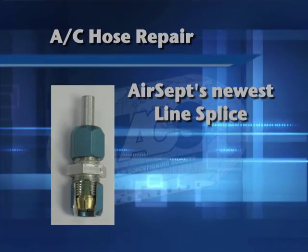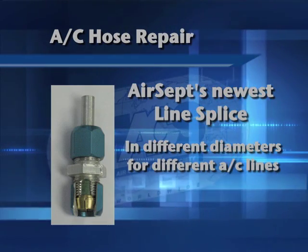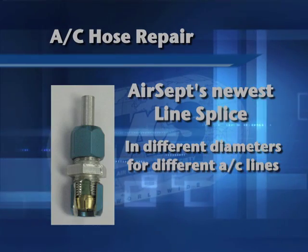Well, we just saw some very interesting information about fabricating and repairing hoses. I hope you found that valuable. But speaking of hoses and lines, say you come across a car that has a line rubbed through or developed a pinhole, and you don't want to have to replace the entire line. A company called Air-O-Crimp has come out with a really neat line splice. Here's a picture of it. It comes in different diameters to repair different diameter AC lines.